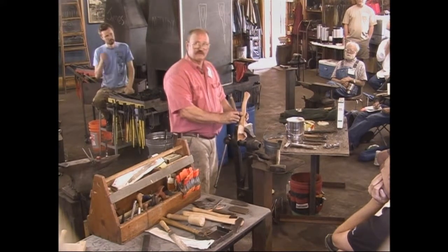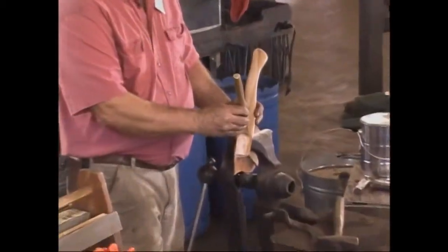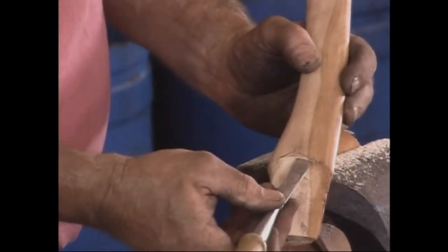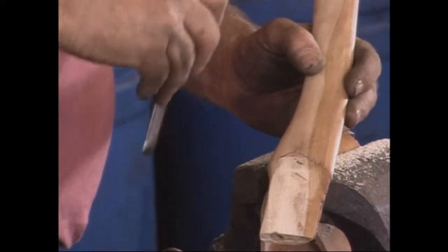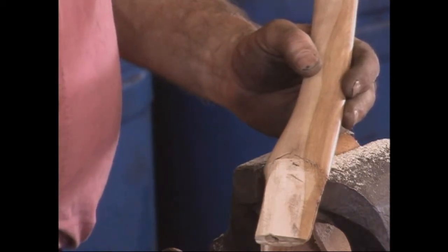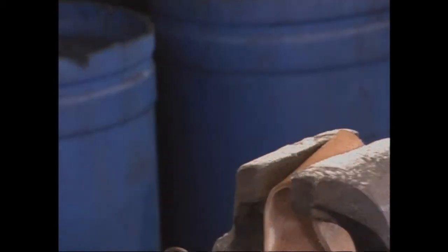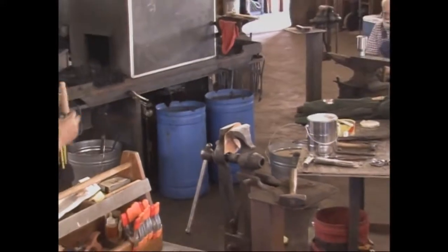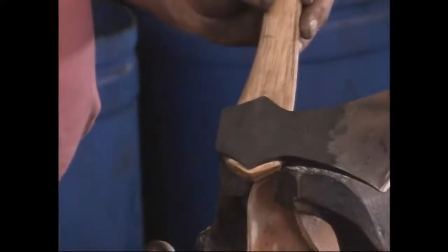Here I go in with a wood chisel, and I cut straight down on that line that I just made, and I start removing that straight down here, take the material out, straight down, take the material out, try the axe again, back and forth. No matter how careful I do that layout the first time, it never really fits when you get that shoulder cut. But when you're all done, hopefully you have a shoulder that the ear fits right up against.